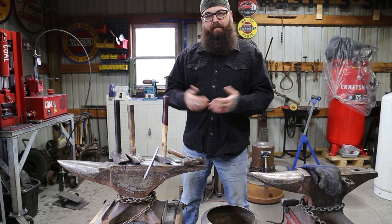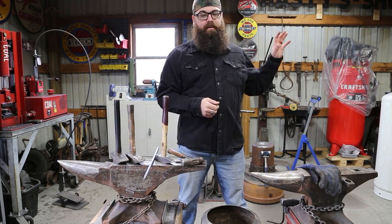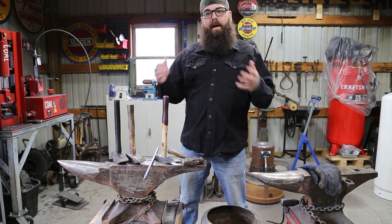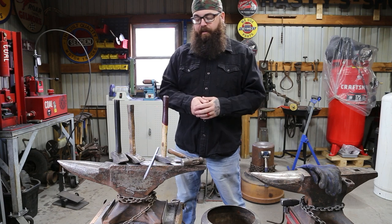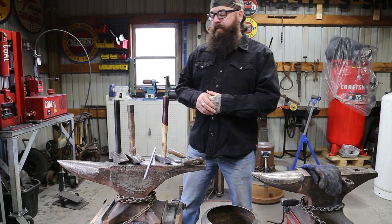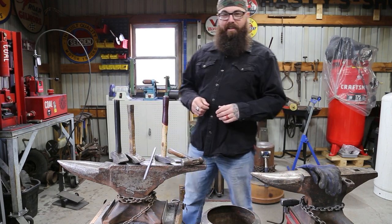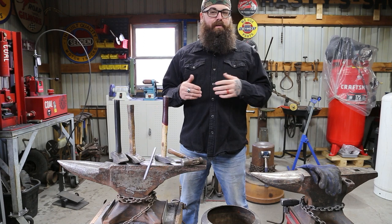It's more or less a matter of preference. I'm fortunate to have a Majestic forge, a Devil's Forge, and a coal forge — I started with a brake drum forge — so I'm well-rounded in understanding what heat levels work for different material. When I pulled out that piece it was a dull orange, not even quite red and by no means yellow, so I knew it would be hard to move, but it let me demonstrate the hammering point. Discredit that if you will as far as not having material hot enough.